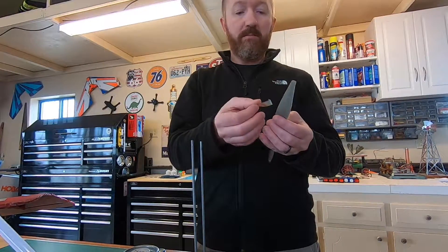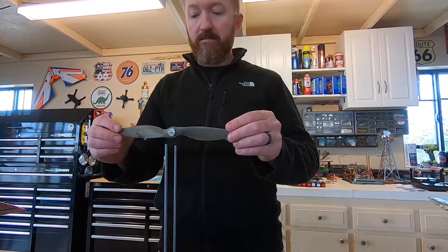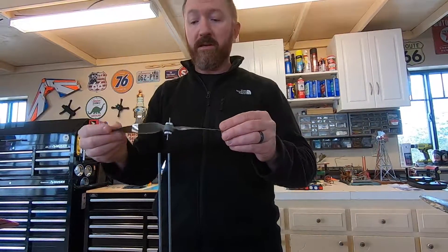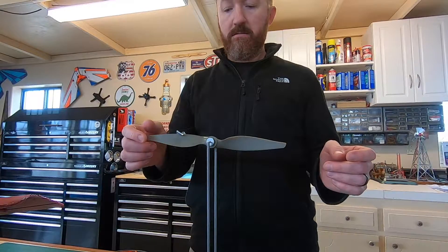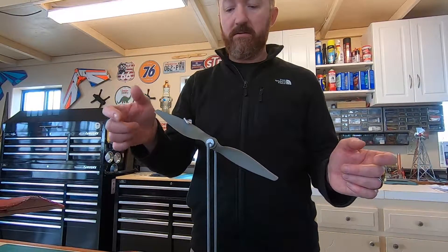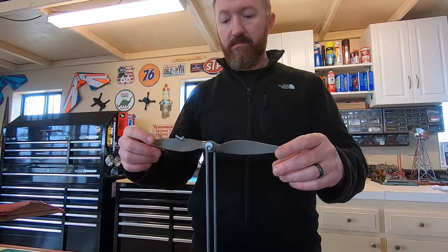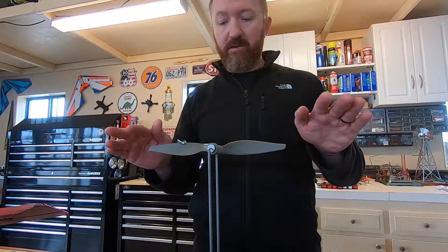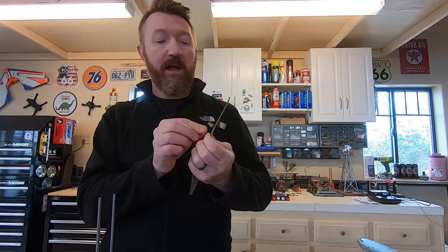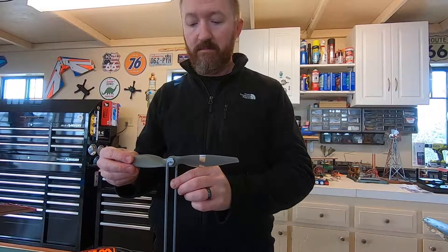Remember this is the light blade. I'm going to stick the tape right in the middle — don't wrap it around yet because you don't know how much weight you need. Put it on the leading edge so the wind will keep it on there. Look at that — that's actually balanced horizontally pretty good. Basically what you're looking for is just for it to sit level. You're always going to have a little drift, but as long as it's very close it's acceptable. Now I'll wrap it around the leading edge and check again. Looks good — pretty good guess!